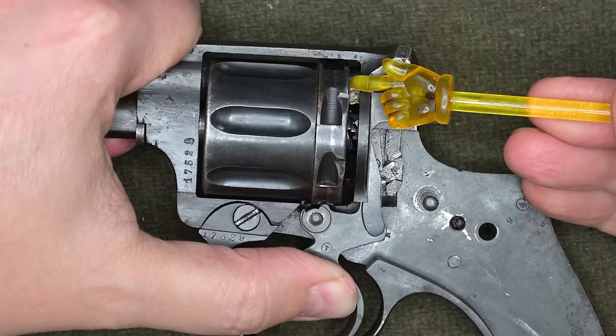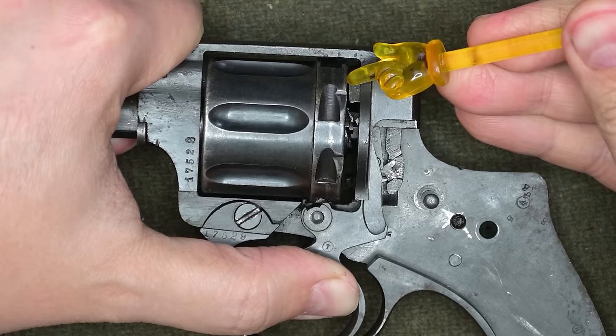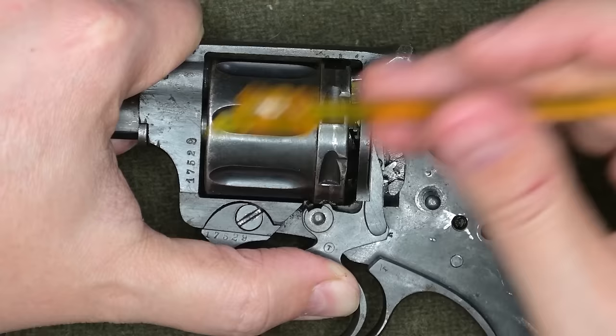Now, it's not perfect right now because we don't have any cartridges in here. The breech block would support the back of the cartridge. There's some thickness in the rim, so you'd actually be further forward like this. But that would be a complete gas seal. Your cartridge is supported, the one that's being fired. It goes boom. It doesn't matter that this gap is here in that case at the rear, and everything works accordingly.